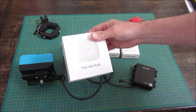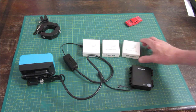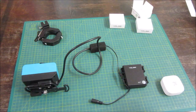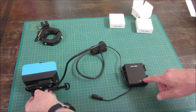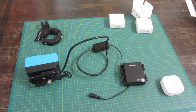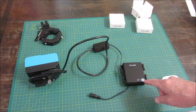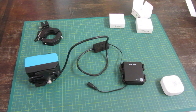Let's get to the installation. I've already taken care of the hub installation. Even though I've set up the hub, I haven't connected the control module to it yet, and I haven't connected the leak sensors to the hub. So first I'm going to connect the leak sensors directly to the control module and show you how it works without the hub. I've plugged the Bulldog into the controller and let's complete a test stroke — valve is open. Let's just make sure it closes.